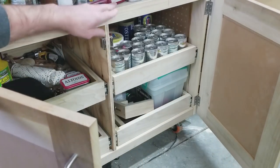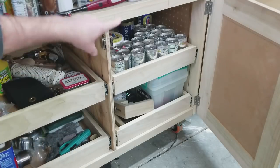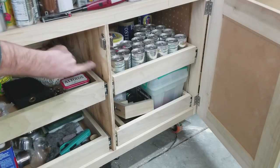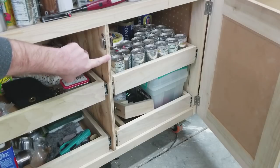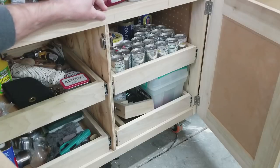Next, I'll work on the top shelf and the center divider. The center divider is cut from 1/2 inch plywood, 20 inches tall, 18 3/4 inch from front to back, and I'll need to cut a notch out of the front corner of it to fit this edging piece.